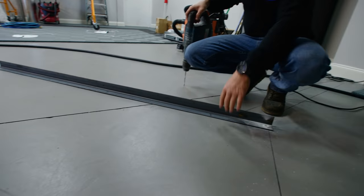I gotta make some cuts across to get a starting point so we can pull a piece out, and then from there I can get it with a sledgehammer and get the corners, because I'm not overcutting here. So typically what you want to do, if you're not worried about aesthetics, you cut well past on both directions, and then this block will come out. But what I'm doing is I'm stopping short, so I'm not doing overcut, because the radius of the blade is somewhere right here, so I'm coming to the edge. So we haven't really effectively cut through the concrete all the way here. So what I'll do is get all the cuts done, take a chunk out of the middle, and then I'll hit this with a sledgehammer. It'll break it here, and it'll still be clean cuts because we've scored it on the top, so on the surface.